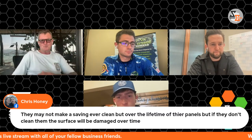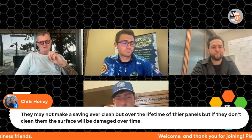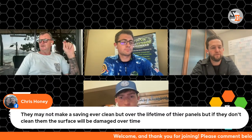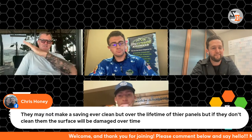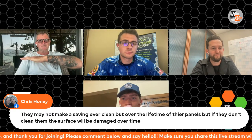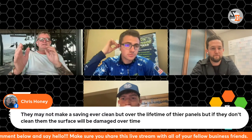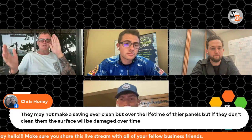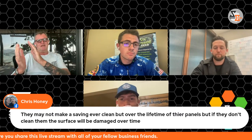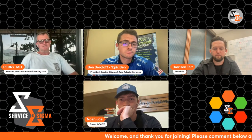The other thing, which you'll find interesting, is that the pitch of the panel is determined by the latitude. Ben, when you say pitch, what do you mean? The pitch is the angle. The pitch of the panel, which is also the pitch of the roof. In your area, they may attach it directly to the roof at the pitch of the roof, because it's within 5 or 10 degrees and it's an easier installation. But actually that's not the case.